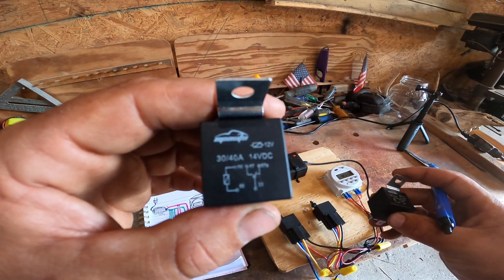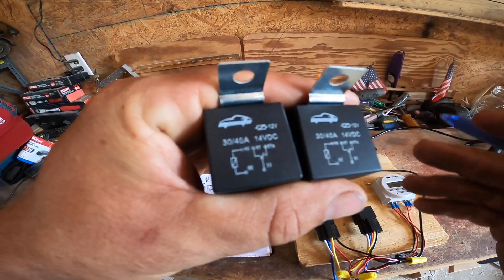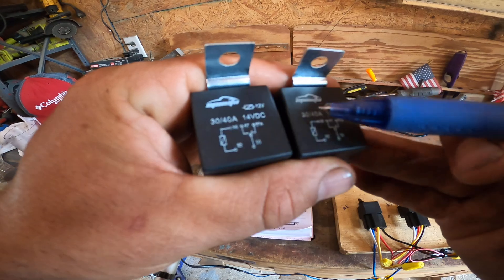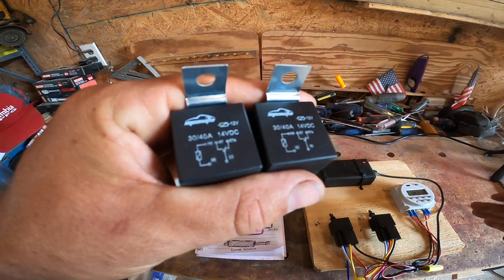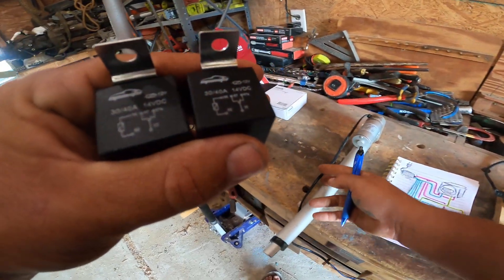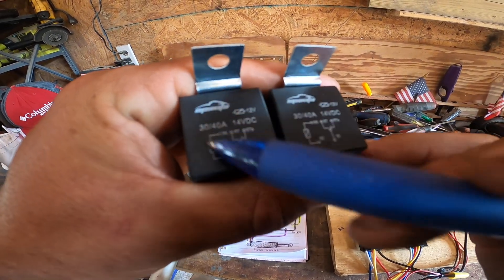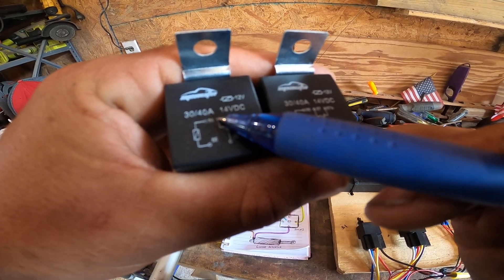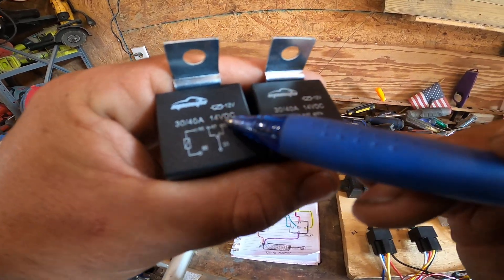In our case, we're doing a reversal using two relays. They're wired almost identically except for two terminals. Terminal 86 on both relays is a permanent negative from the power supply. Terminal 85 on both, which goes to the magnet, receives the triggered positive out of the timer. Terminal 30 on both goes to the actuator wires. The only difference is terminals 87 and 87A. On relay one, 87 is negative and 87A is positive. On relay two, 87 is positive and 87A is negative — so: negative, positive, positive, negative.